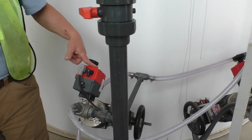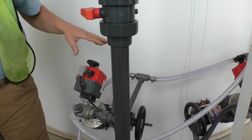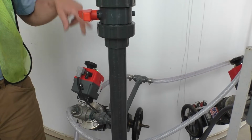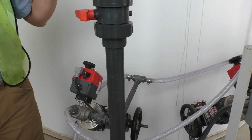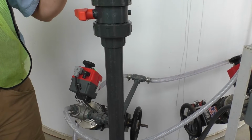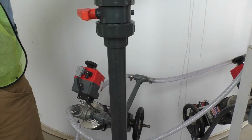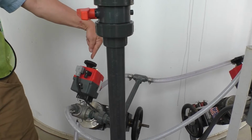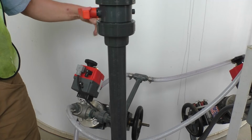So we're going to send our programmer by here, and he's going to hook up to the PLC and make a little quick change and increase the timer on this. The reason it's flushing right now is because the line's full of water. But when it's got lime in it, I'm not satisfied that it's completely flushing in only one minute. So we're going to go to 5 minutes and be safe, because it's only water going right back in your system. It's your water. See it closing? Okay, now it's done. Now put it back in hand. Right up. Wait one second.